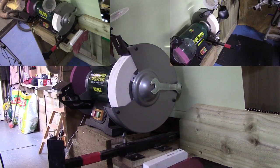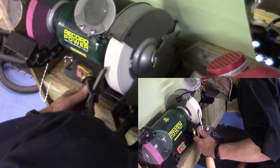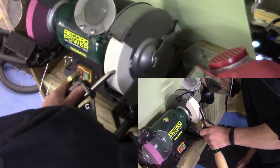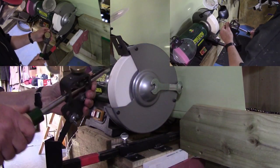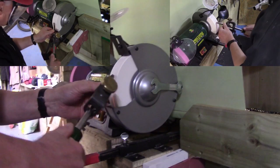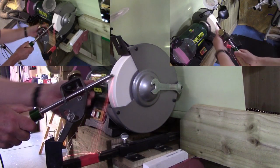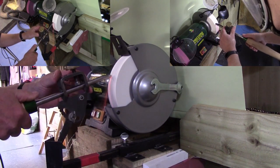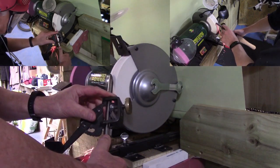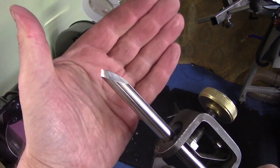I'm using the One-Way jig and protrude the tool 75 millimeters beyond the jig, setting it up to the angle on both the face and the side of the tool for the swept-back grind. Switching the machine on, tightening up the cradle, and moving from side to side — grinding the toe. Two passes over the wheel on each side should bring the tool back to a lovely sharp swept-back ground ball gouge with a clean facet all the way around and ready for use.